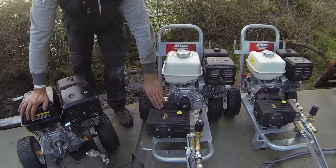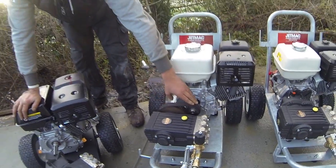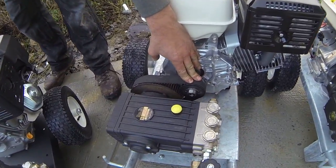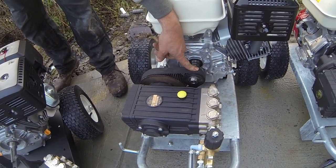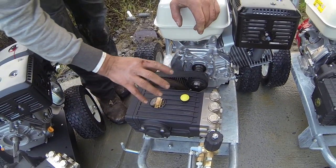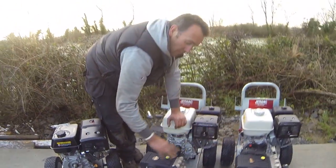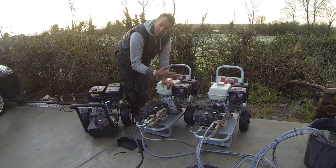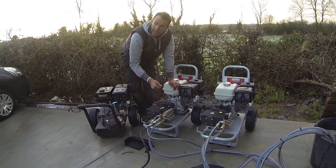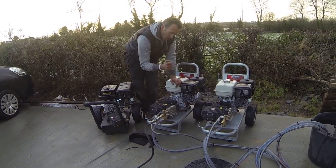If you look here, because this is a big wheel — it's a 62 tooth pulley — and this is a smaller tooth pulley, you have a reduction. So basically, when this shaft here is spinning at about 3400 RPM, this is only doing 1450. So these pumps are definitely the more industrial, because they only work at half the speed, so they're more fit for a lot of work and more suitable for everyday continuous hard work.